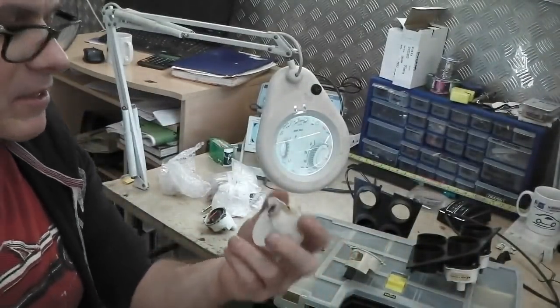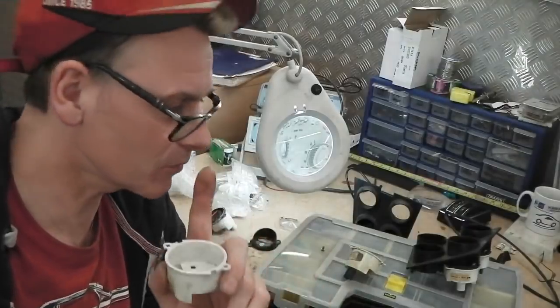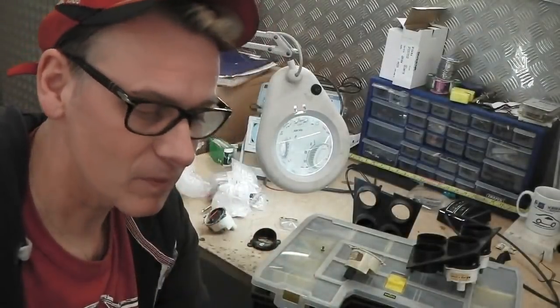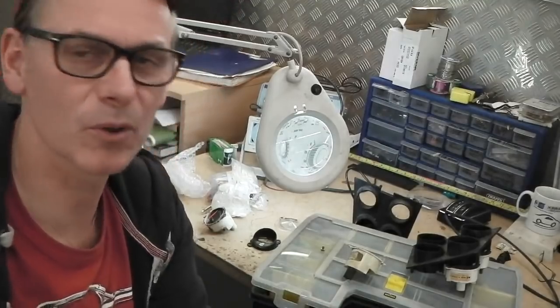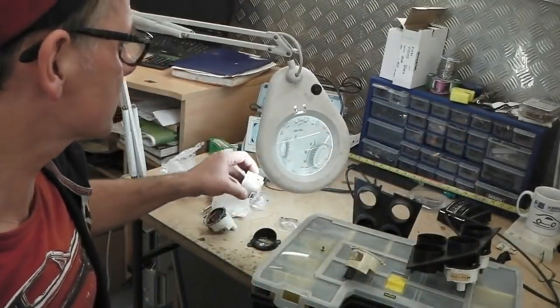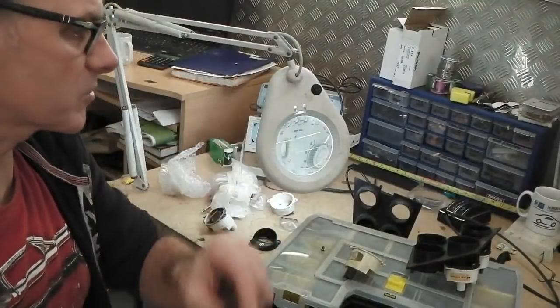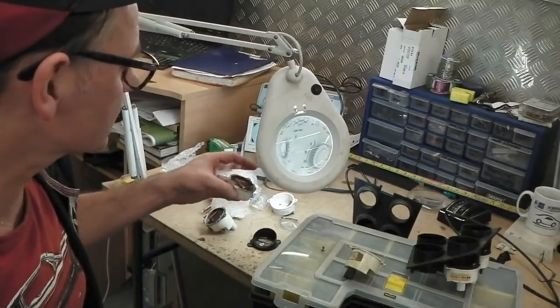You see the thing is that people put the wrong bulbs in there. I mean, even with the right bulbs in there, they still used to get a bit brittle. But with the wrong bulb in, that's because of the wrong bulb. Because there's different wattages of those little wedge bulbs that you can fit in these. People put the wrong ones in and cook the gauge.